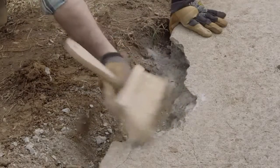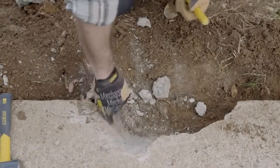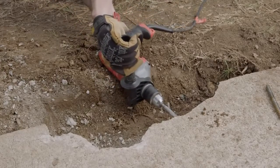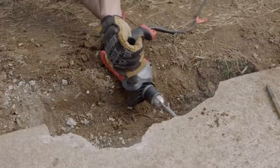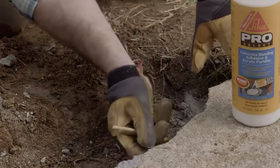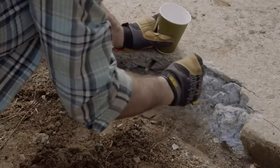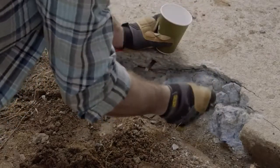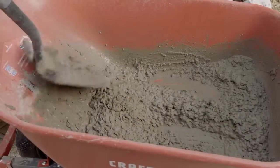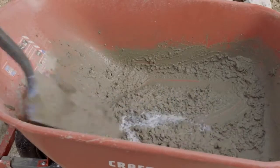Clean out all the debris with a wire brush and broom, and chisel out until you have strong concrete on all sides. If this piece will see a lot of traffic or weight, like a concrete step, then you'll want to drill out a hole with a masonry bit first. Take a piece of steel dowel — called a rebar rod or re-rod — coat it with a latex bonding product, and insert it into the hole halfway. Apply that same bonding product to the broken edges of the sidewalk, making sure to get into all of the crevices. Mix up your concrete patch with water and add some of the bonding product to the mix. Read the manufacturer's instructions for specific amounts.